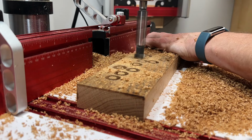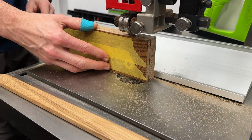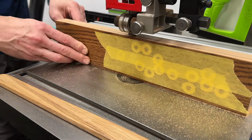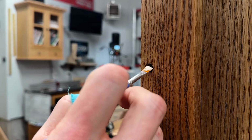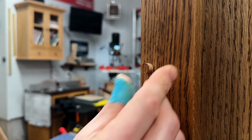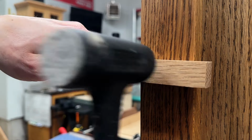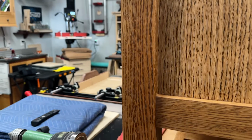And we also had to plug those holes on the back two legs where we had screwed the cabinet into the leg. Now again, these will never be seen, but I wanted to, you know, cover those holes. So I took some pre-finished white oak and drilled out a bunch of plugs and then cut them and mixed and matched them until they looked decent. They're not perfect, but decent. And here's a little top to bottom scan just so you can see.